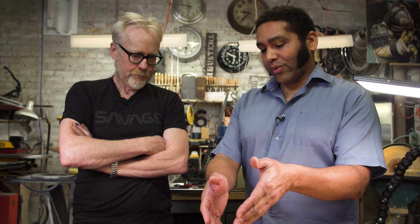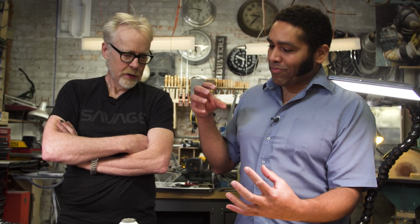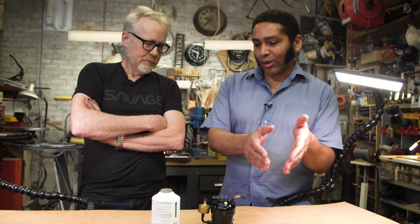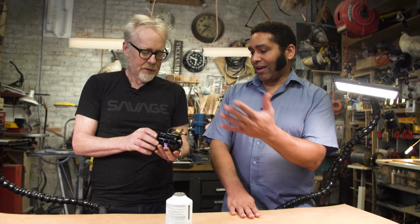If you're an engineer, you'll know this as a reverse Rankine cycle, which is a thermodynamic cycle that's fully closed loop, and we do work with a piston or a rotor or some kind of machinery that does that compression. So we're putting mechanical work into the system. We go from electricity to mechanical work to thermal, and then we get rid of the thermal, and then we reverse and come back on the cold side, boil off, turn to a gas, and then we suck gas back in the inlet. And it strikes me that this is an especially tiny compressor.